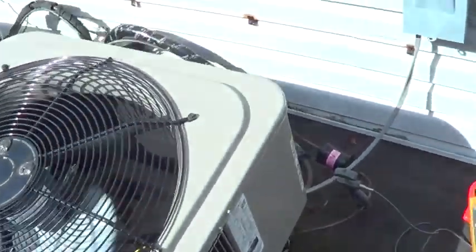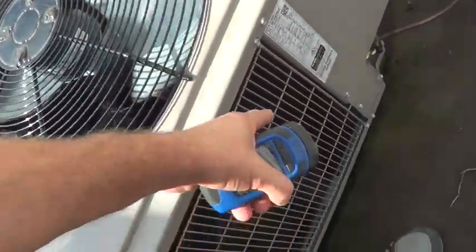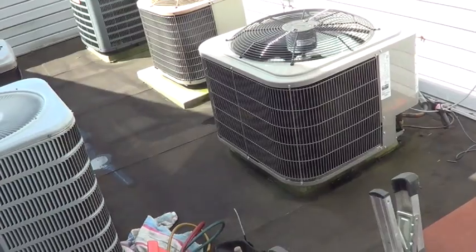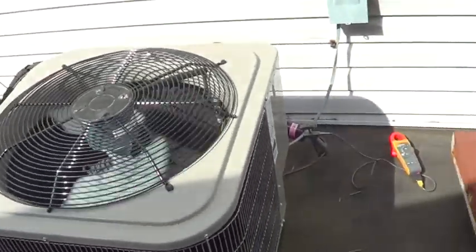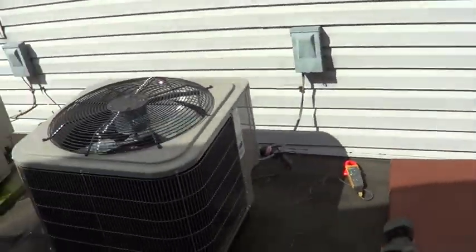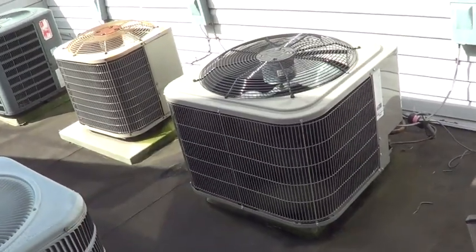The telltale sign that your capacity is low is that your liquid line is right at your ambient temperature - that means you're not getting any heat transfer between the leaving liquid and the surrounding air. Outside is 75 degrees Fahrenheit right now and I've got a liquid line temperature of 75 degrees Fahrenheit. The compressor got smaller, it's pumping oil like crazy - oil just goes everywhere on your gauges on both the high and the low, and the condenser is way too big now for the undersized compressor.